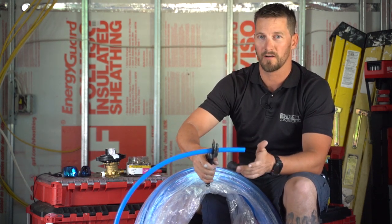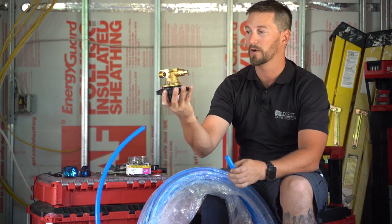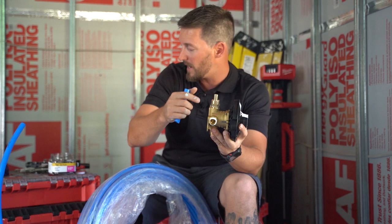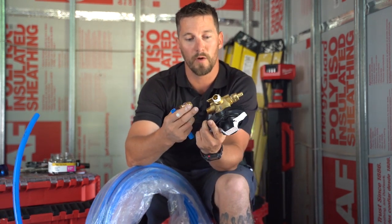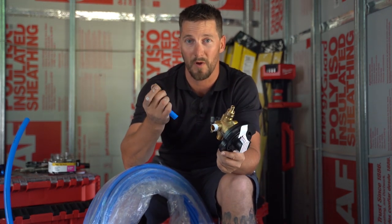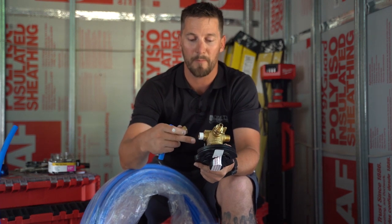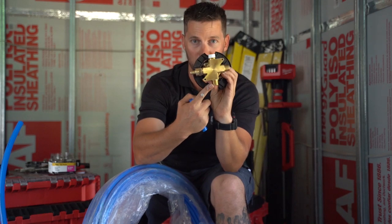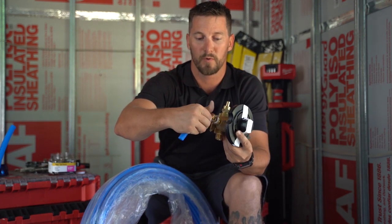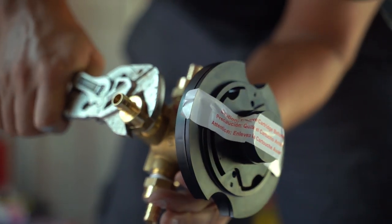This is my shower valve. I have one end — this has my PEX connection on it, which I just took off. This PEX connector is going to thread on to any one of these ports. All of the ports on the valve are labeled. I'm going to show you just how stupid simple it is to use PEX. What I'll do is put pipe tape on there — wrap it around a couple of times. I'll hand tighten it until it gets relatively tight, just a couple of turns. I don't have to get crazy with it. Now that is ready to receive our PEX.